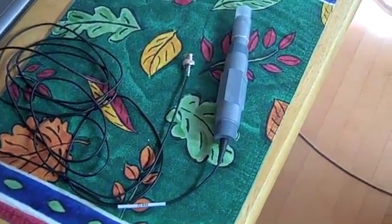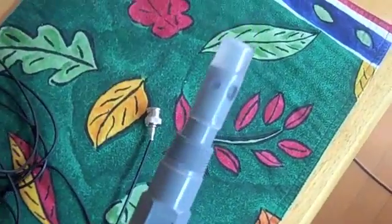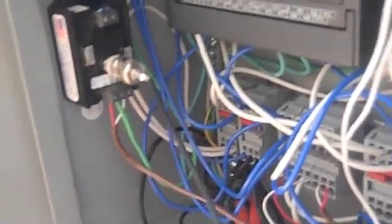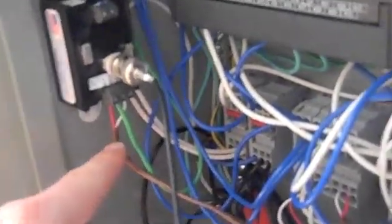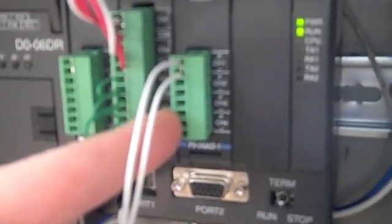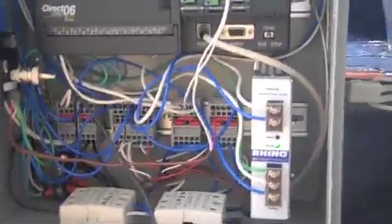One of the last few pieces of the control system effort came in. I've got an industrial pH sensor with a BNC connector on the end, which is going to go into my control box. I have a little amplifier circuit — the BNC plugs into that. This amplifies the millivolt signal and turns it into a 4 to 20 milliamp output, which then goes into a little analog input module for 4 to 20 milliamp signals. Once I get that going, I'll be able to read pH continuously. Now I've got to work on the control screens for this whole thing.